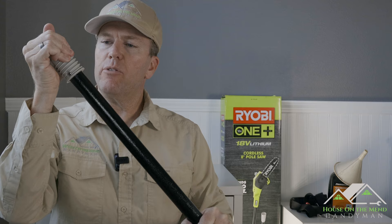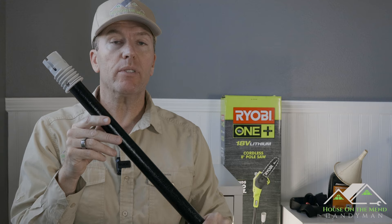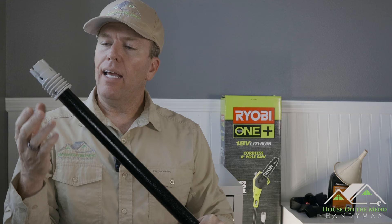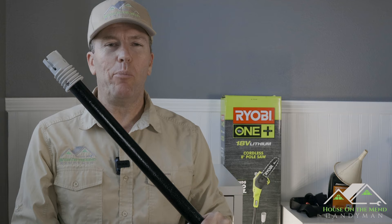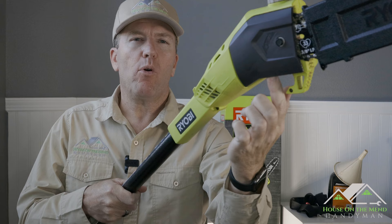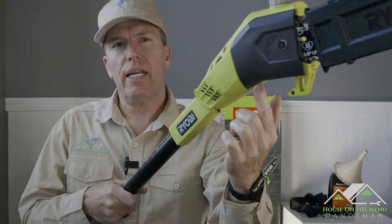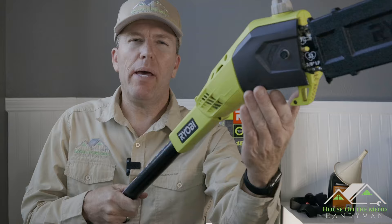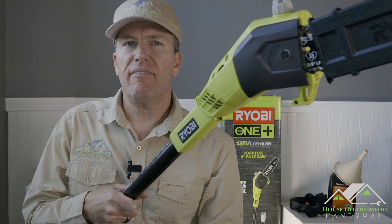When you put all three poles together, the wobble was really uncomfortable and unsettling. I almost thought when I first noticed it that the pole was cracking or about to break, so I immediately stopped cutting and went to investigate. Sadly, I found out they used rivets, which is just so disappointing. One last thing I noticed while cutting: this protector that covers the gear and where the chain comes onto it did fill up quite often with debris from the trees. Thankfully, that little tool that came with it to tighten the chain also worked really well to clean out this area — though they probably could have come up with a better way to shed that debris, as I had to clean it every time I came down to refill the bar oil.